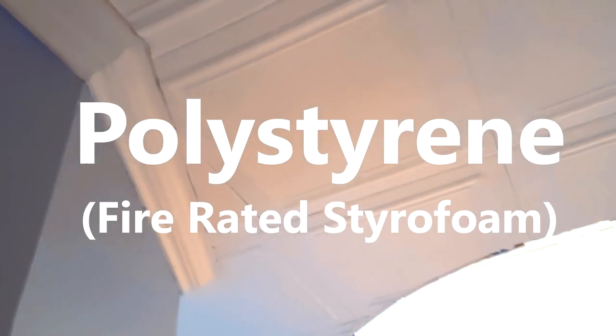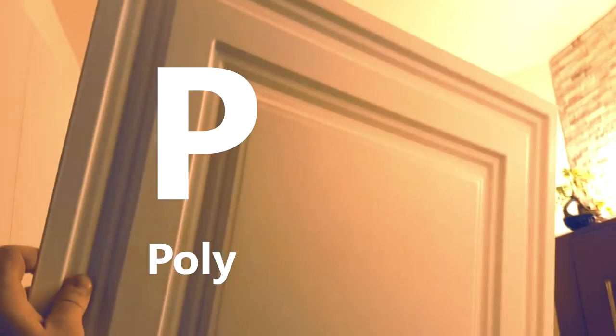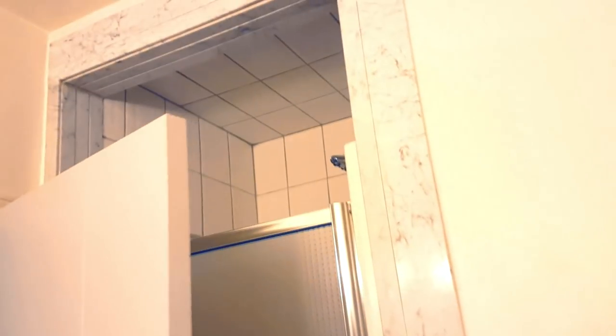The reason we're using these and not those is those are polystyrene, so they're styrofoam, whereas these guys are PVC, and there is a shower in here. The odds of paint peeling is very low. We're going to be putting this in there anyways as a decor piece to go with the wall.